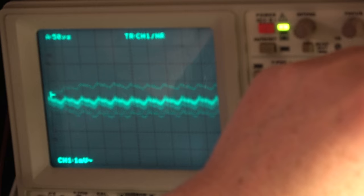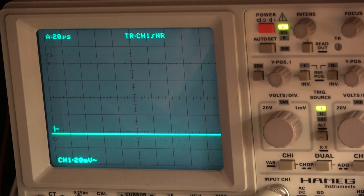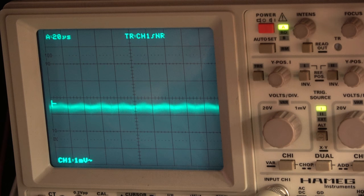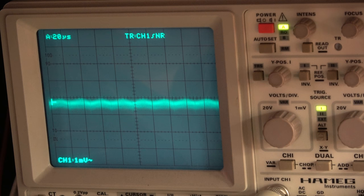When I go back to 20 millivolt as we had in the earlier video sequence, we see nothing — the signal is very stable. Plus 5 V is also very stable; the voltage is nearly constant. The ripple can only be seen at the highest resolution of 1 millivolt times 10, so 10 millivolt per division — we have about 5 millivolt ripple, which is one per mil relative to 5 V. Values and voltage ripples are now okay. The capacitor replacement was very good — it was necessary but also very useful.